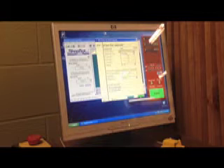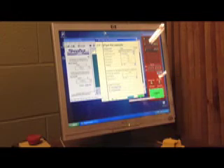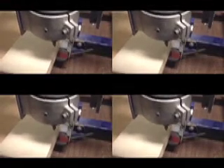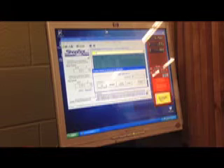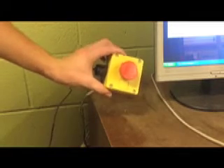The router's on and off switch is on top. Go ahead and turn it on. I've shut off the router so you can hear me talk since the router is too loud. At this point your router is running — go ahead and hit Start by clicking on it. The space bar as well as the stop button are used to pause the machine, and there is also an emergency off switch — only use this if needed.